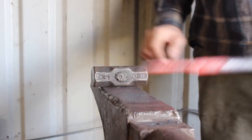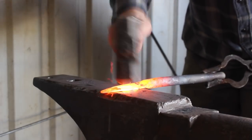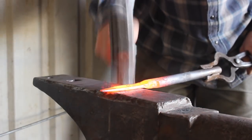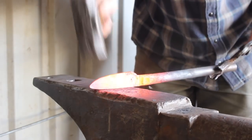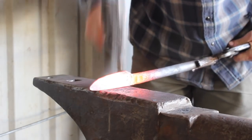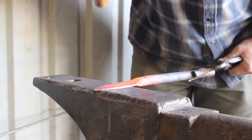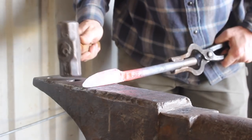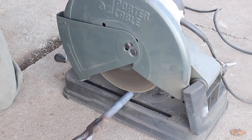There's definitely plenty of stock here to forge a blade of at least this size. I wouldn't recommend trying to do an integral with anything smaller than 7/8 inch diameter. That might seem big, but once you get it out of the forge and start hammering, it's easy to make that bolster area a little smaller — it's not very big around. One inch or even an inch and an eighth would definitely be preferable, especially for bigger knives. You can always forge it down smaller if you need to.